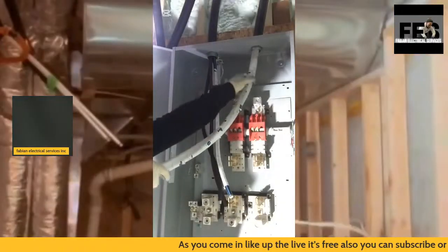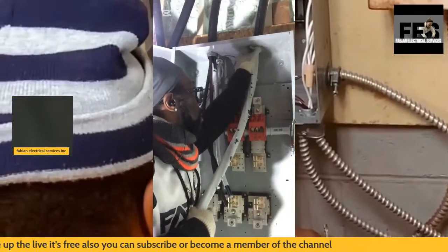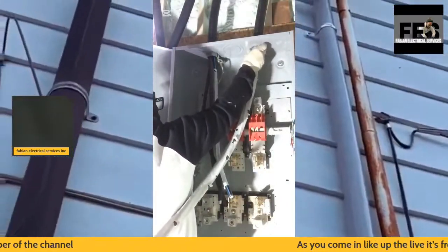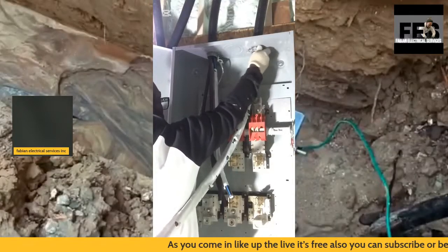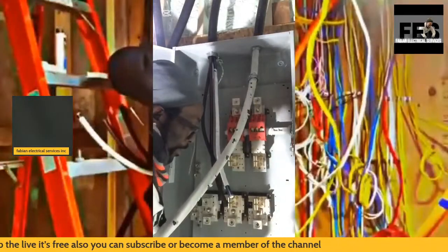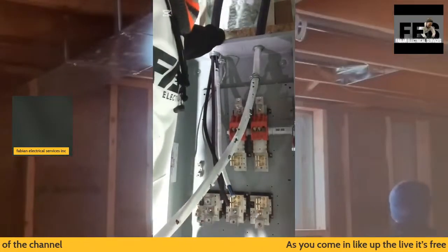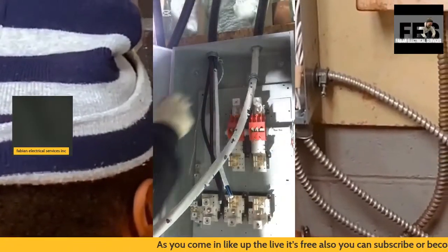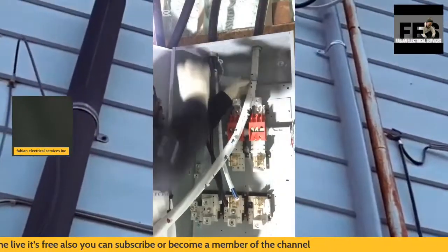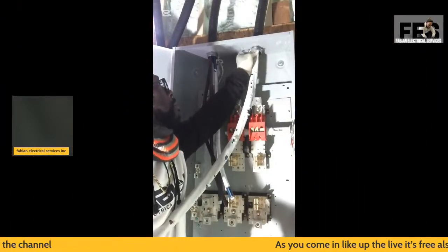I also make sure to put my ground bushing on first. This installation is going to come with the ground bushing connection. The reason being is the ground wire has to be grounded off to the actual ground clamp. As you can see on the left hand side, you're going to see the other installation. You're going to see my wire is grounded off onto the ground bushing. It is in code compliance. It is a code rule that states that. It is inside of the electrical code book where you would find it. You just have to search.